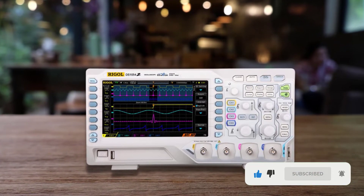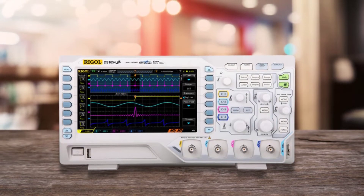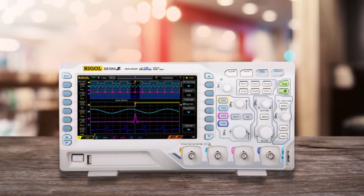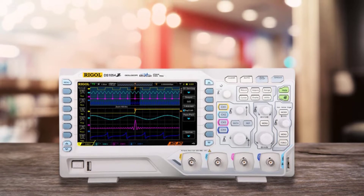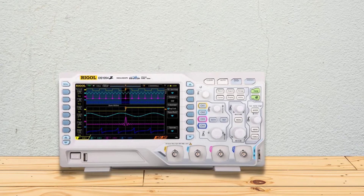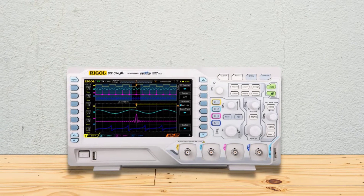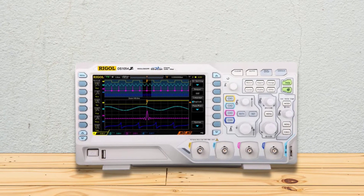The case is made out of heavy-duty scratch-resistant plastic and all buttons and connections are quite solid. The overall build quality of this oscilloscope is as good as that of an expensive top brand. You may get some free device tools for higher frequencies to assist in data collection via USB and perform an FFT on the CPU of your machine instead of having all the heavy workload on the scope. Furthermore, the DS1054Z will allow full-screen XY monitor with only some firmware updates.